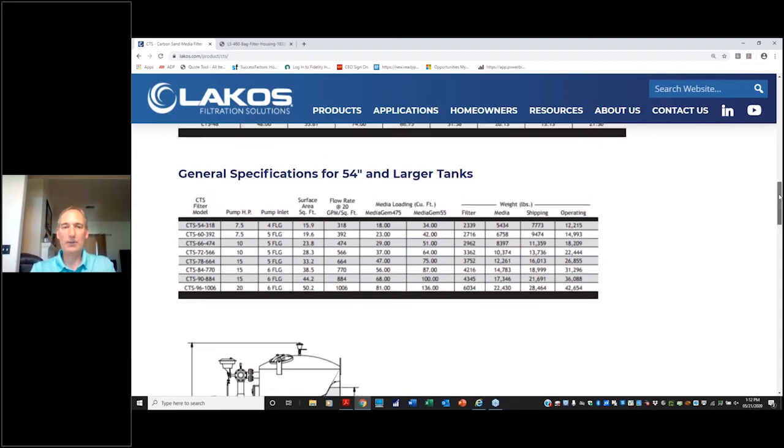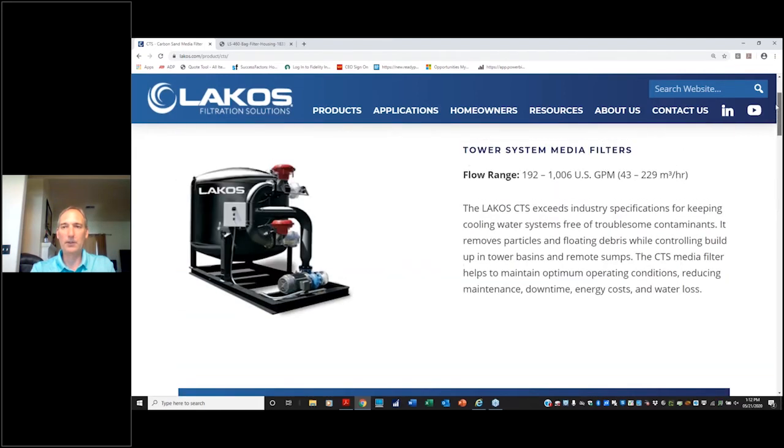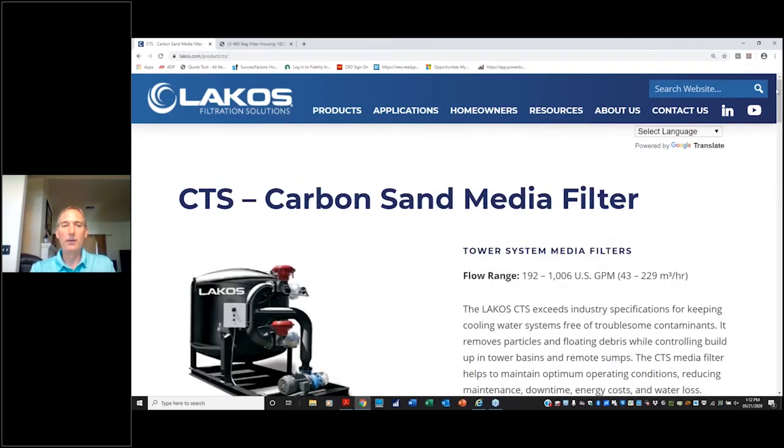So if you guys decide that you want to look at sand media for some process cooling of sorts, or if an owner is really dead set on having that, just make sure that you take into consideration some of the things that are, I'll call kind of a nuance when you're used to selling separators that just operate on their own. The other thing I'll point out is if you look, they're a pneumatic actuated valve. And so we also have an option for electric. So we just need to make sure they have air on site to operate the standard equipment.